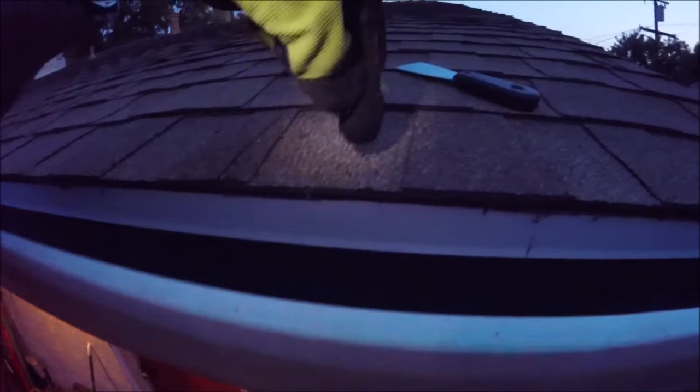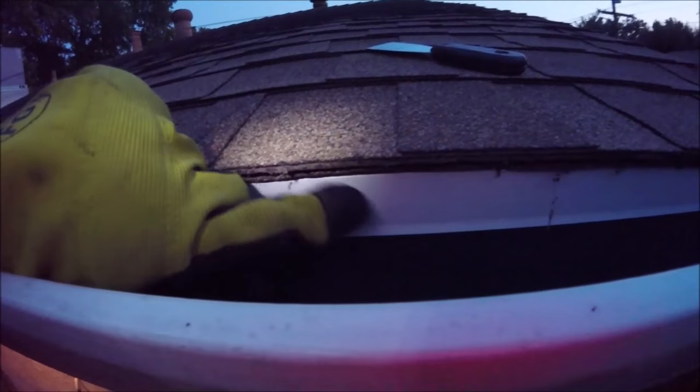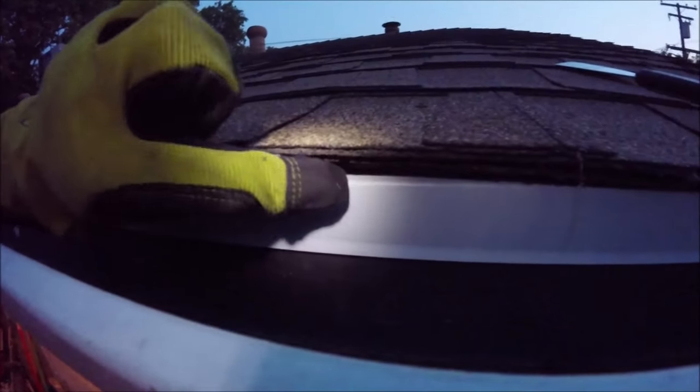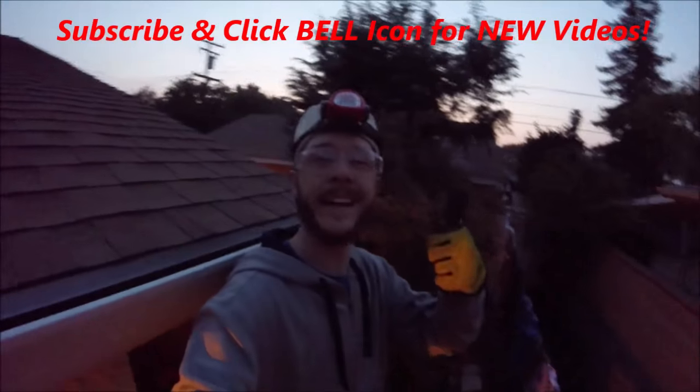You have a couple different ways of mounting this. Ideally, if you can peel back the shingles, you want to drive a short roofing nail or screw through the top underneath the shingle — you don't really want to face-nail it if you don't have to. But if you do, you're going to want to cover it up with some sort of roofing sealant or roofing tar. Or you can put some dollops of roofing sealant or tar right underneath the shingles and on top of the drip edge and then press it down — it'll just glue it in. It just has to be held in.